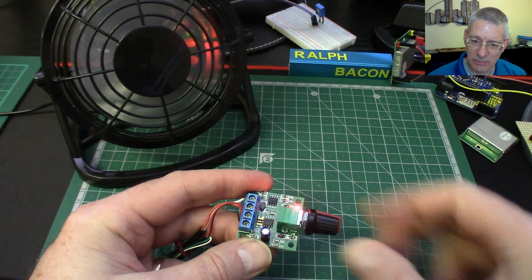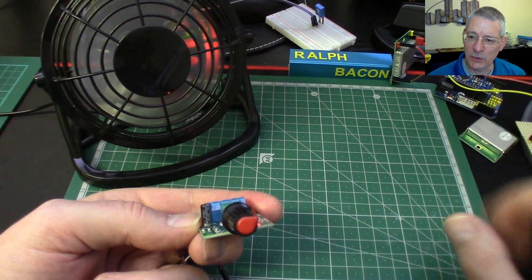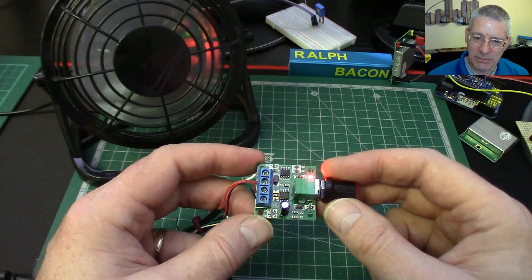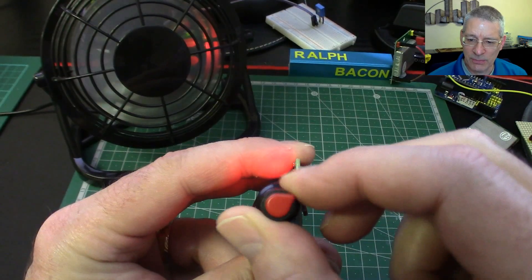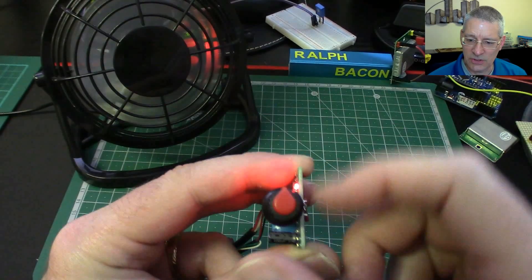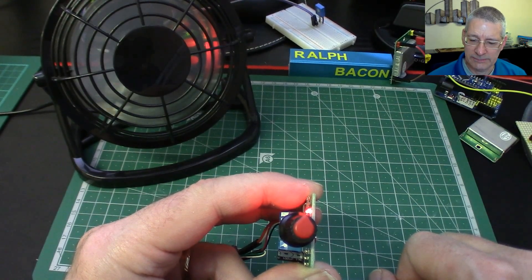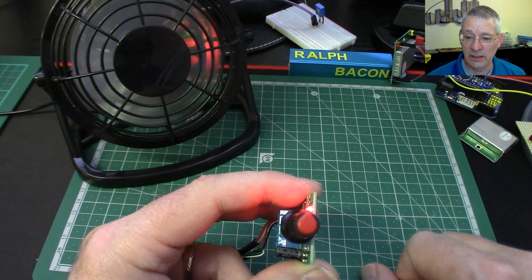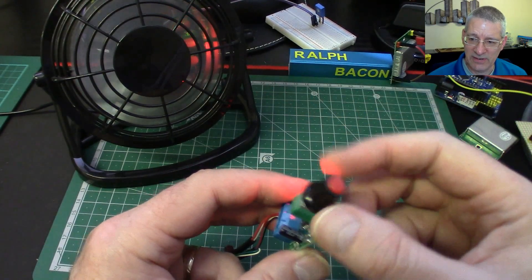So I can take it down to about there — that marking there — and that's probably enough with a nice low noise level. I thought great, that's going to save me an Arduino and all the mucking about. But then I discovered that when I first got it, the actual range of movement I needed was probably from full power to about there — any lower than that and it had stopped. So I put it on the scope and could see some very short pulses. The frequency is adjusted by this, but it just wasn't enough for that particular fan.